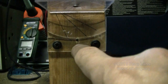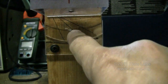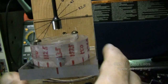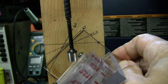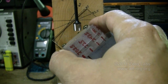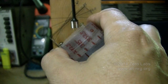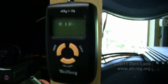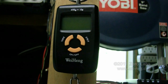There's a guide at the bottom created by two thicknesses of acrylic over top — one sheet here — and it just slides underneath like that. So I can rotate it. If I want to check it at 22 and a half degrees, I set it there. If I want to check it at 45 degrees, I set it there. And then I rotate this section of the magnet keeper to check the magnetic strength or the pull in terms of ounces as indicated by the digital pull scale.